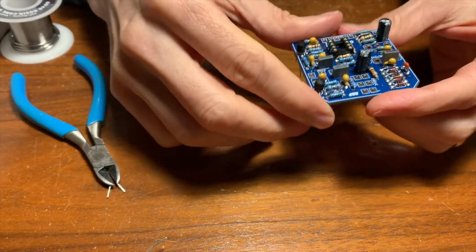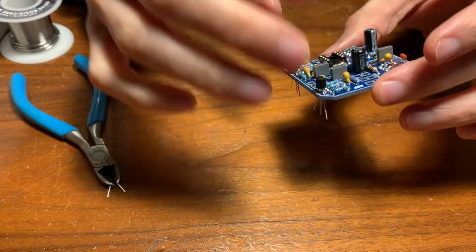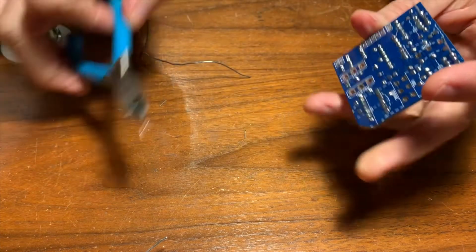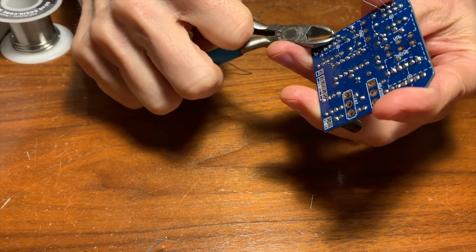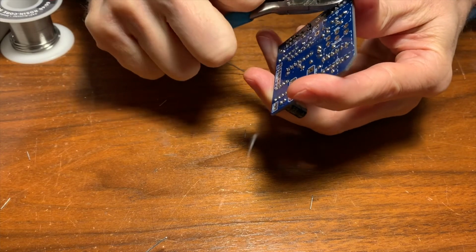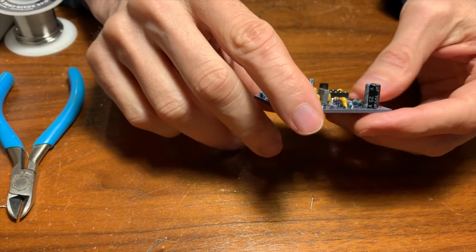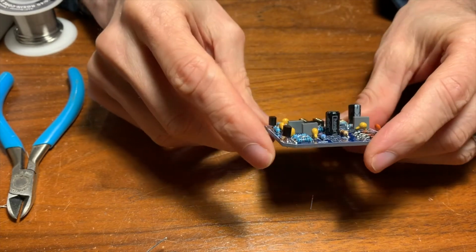The funny thing is that a lot of people make a modified version of the Tube Screamer. There's a lot of modded ones, and the most popular mod that people build stuff around is taking off the 2 transistors. So it's just the op amp. They just take off the input buffer and the output buffer. And what does that do? I'm not exactly sure. I think it simplifies the whole circuit. I don't know that it actually does much for the sound sonically. Doesn't hurt the sound. I mean, you kind of lose the buffer, but I don't know. Some, like the Zen Drive, are that way. It doesn't have these, and it sounds great. Anyway, so there we go. I think we're good, right?